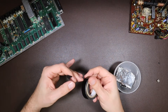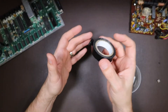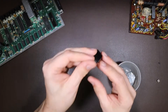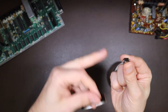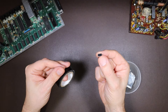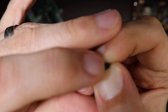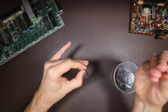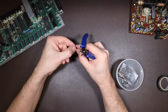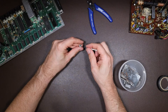I don't have a lot of good ideas, and this probably isn't one of them either, but I've got some electrical tape — cheap tape from the pound shop. Because it's quite thin, I want to wrap this ferrite core a little bit to maybe get enough engagement in here to keep it in place, though it won't be very adjustable. I've done one tiny wrap, pulled it very tight so the thread appears through. We'll see if it will stay in the RF can. I think this is probably worth a go — we'll see if we can at least get some basic audio going.